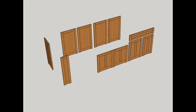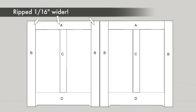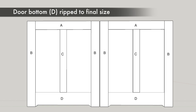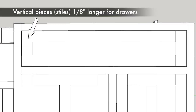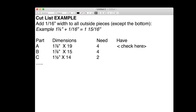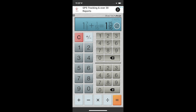I start with my model in SketchUp — check the description to download my kitchen model and play around with it yourself. As noted, the inset gap is 3/32 of an inch, which is pretty standard. When generating my cut list, I want to rip the pieces 1/16 of an inch wider to give me some space to later clean up. The stiles also need to be 1/16 of an inch longer to accommodate for this additional width. I don't rip the door bottom piece larger because it doesn't touch anything at the bottom. However, drawers are surrounded on all four sides and need to be 1/8 of an inch taller to accommodate the increased width of the rails. I generate the cut list by hand and use a simple iPhone app called Fraction Plus to do the addition.